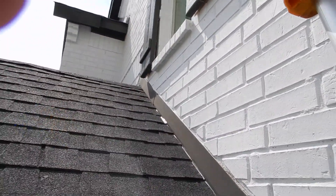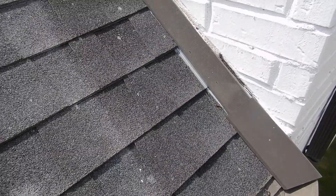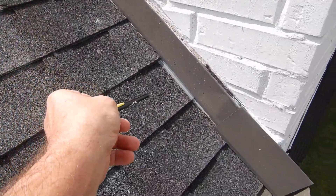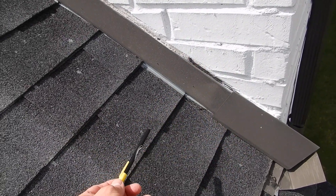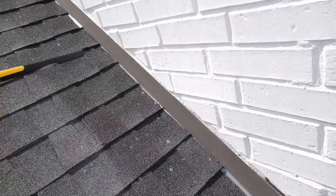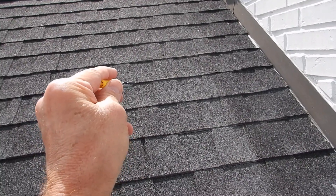We're over the northeast corner of the roof covering and I'm seeing a couple things going on here. The first one is this counter flashing — the counter flashing is over the step flashing underneath it. Step flashing goes behind the wall, goes underneath the shingles, so any water that gets through the wall — the brick is porous — comes out and goes down. That's counter flashing. If you look, this piece is installed over that piece. If you look at the shingles, they cascade down: that shingle is installed over that shingle, installed over that shingle.